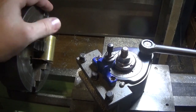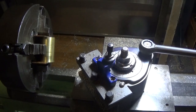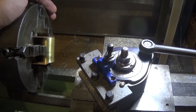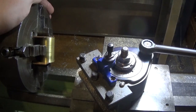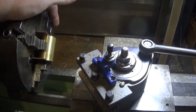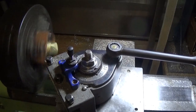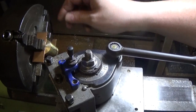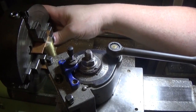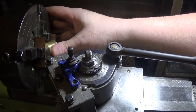Check it anyway. Any decent four-jaw chuck, that should be how it is. So that's a pretty easy setup. With all this rain I've got a bit of an overload somewhere in the circuit and I keep getting an error message on my VFD, but we'll have to live with that. Our next job is to machine this down. When you take that first cut off there, this line here should be pretty parallel — it should have taken about the same amount off one end as the other. And if you haven't, there's something wrong. That's a good way to tell.